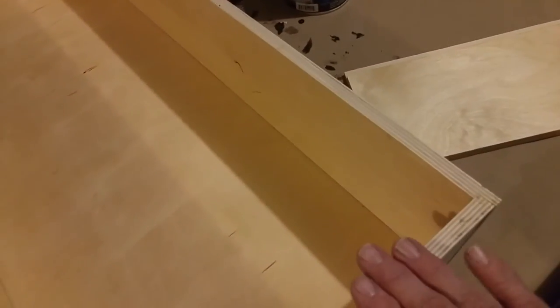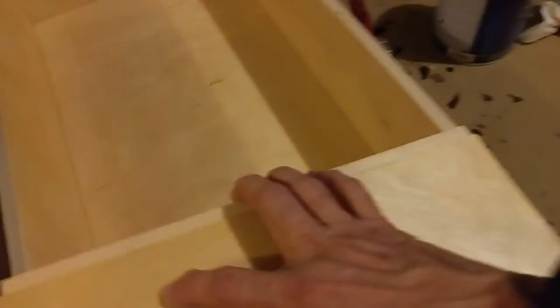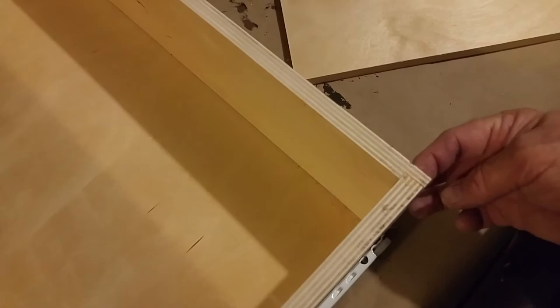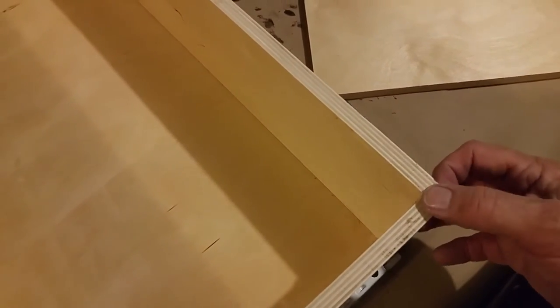Assemble your box with all of the correct dados on both the bottom and two of the sides. These two boards each have a dado on both ends, whereas the other two boards don't. Once it looks good and assembled, take your square, set it in, and get it perpendicular. While it's held in place, nail it in with your pneumatic nailer — that'll hold it nice and tight. Then go to your next corner, and the next. Once done, set it on the side and measure carefully for the bottom to fit into your existing dados. The whole bottom is recessed in, which gives it great strength.